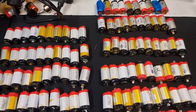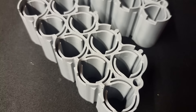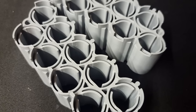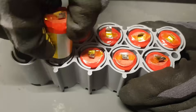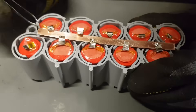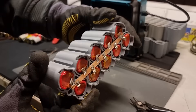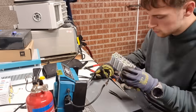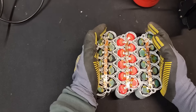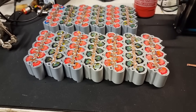Finally, 130 cells extracted, balanced, and grouped. To hold them together we're using 3D printed modules — each module holds 10 cells, forming our parallel groups. We've gone for the spring tab design again, which is really needed because look how much the dimensions can vary between cells. These modules also slot together to help make a solid pack. Making one module is pretty easy: slot in all the cells, pull the tabs into the center, solder them up to a copper strip, flip it over, and repeat for the negative side — then repeat this 12 more times.